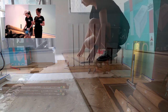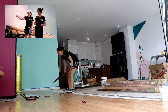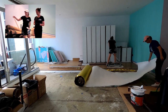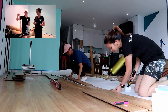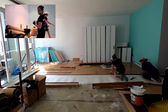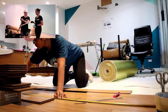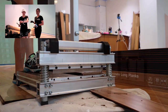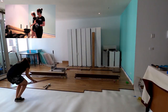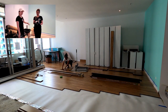Along the edge, the way that the carpets are stuck together is with carpet tracks — they look like this. What you've got to do is just go around the edge and pull these out, but be really careful because they're full of nails, so wear gloves at all times. We have a range of tools to get off those carpet tracks — grab a chisel. Normally the easiest way is to hit where the main nail is into the ground, then lift it up and jack it up a bit and keep going. For safety reasons, have a bin or box close by so all your excess waste is thrown away and not left where someone could step on it.